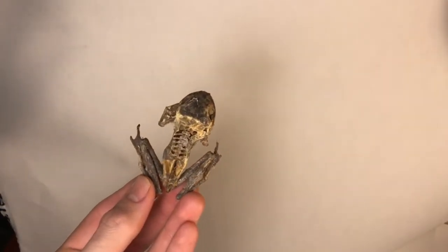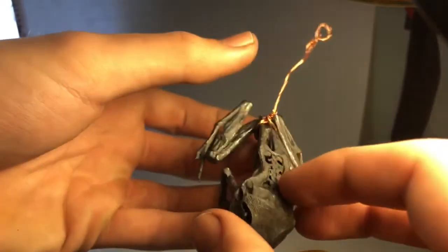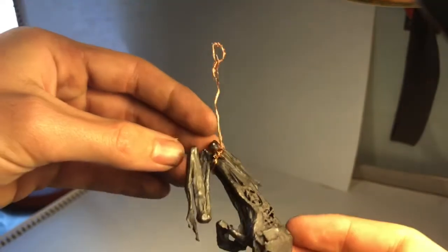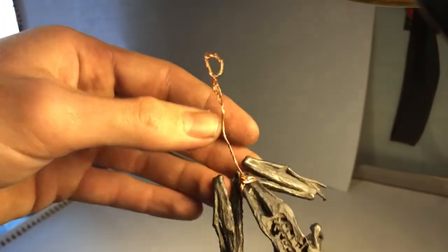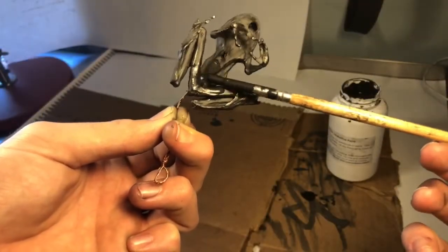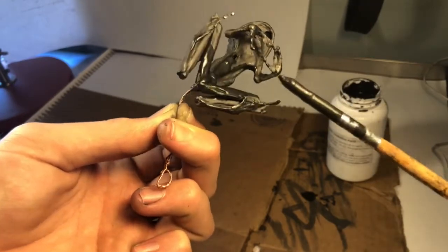By layering the frog with conductive graphite paint, I was able to use the frog as the cathode in the electrolytic solution. My first couple of coats of graphite paint went on smoothly and I wrapped copper wire to the frog in order to get the best possible connection. Here I am painting graphite over copper wire to better conduct the electricity flowing from the battery to the frog.